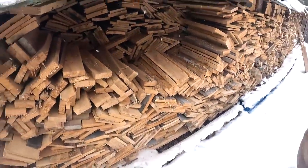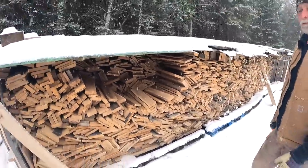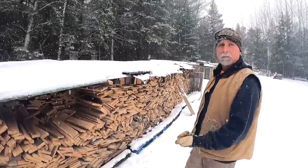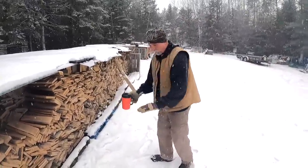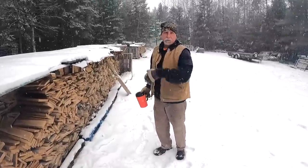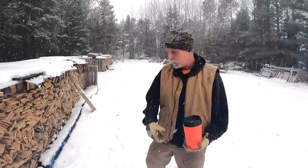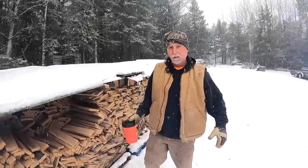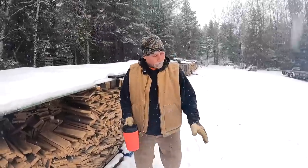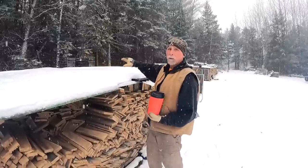I tried to cut it all at 16 inches so it stacks well. This was a lot of work, but on the other hand I didn't have to split it. What I did was lay stringers out and use the forks on my tractor to lay it all down, then stack up about four rows of lumber. I'd mark it out with a marker, then just take the big 395 saw and go bloop bloop bloop — one pass per cut. I'd have one pile there, one pile there, and just move the pile over. I'd lay down pallets one row at a time as I filled each row.